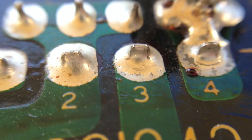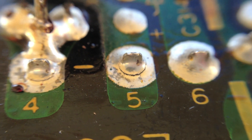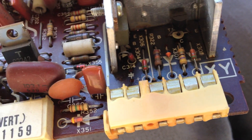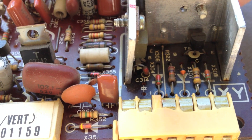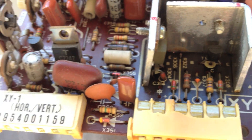The others look fine. So if you're having electronics issues like this one, and you take the board out and see that one part of it is pretty dry and crispy — well, after a while with all the expanding and contracting, some of the joints are going to fail. So I'll just take that with a little solder and we'll see what happens.